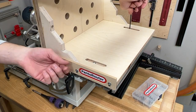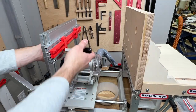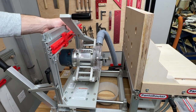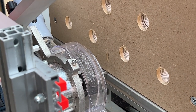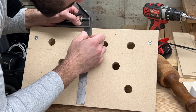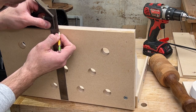With the router unplugged and the pointer installed, insert the 6mm shaft or the guide bearing into the center hole of the template holder and scribe a centerline on your jig. Using a reliable square, carry that line up the entire face of your jig and across the top.